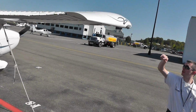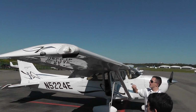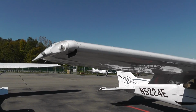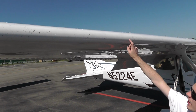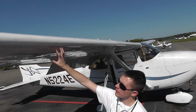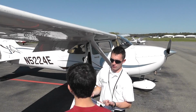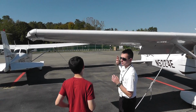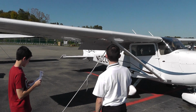Okay, we check the lights already. That's a great point to remember. And no, not dead bugs, but that's not a problem. Once in a while, especially on maybe the 05s or 06s, a little bit older, you may see a nick or two. It's not a huge deal. The main thing you're looking for on the airframe is any structural cracking or anything of that sort. That would be more of a problem. But little nicks from rocks, these planes can take quite a beating being training planes, so we don't worry about them too much if you happen to see one.